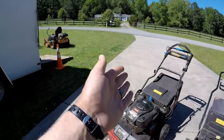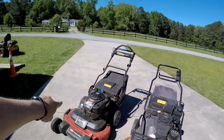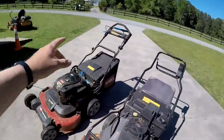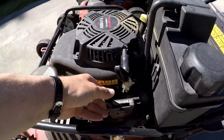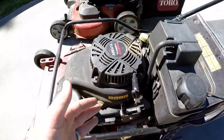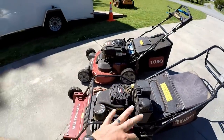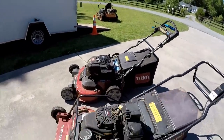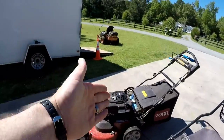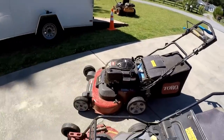This residential one is way more user friendly and lighter. If I pull up to a nice manicured yard tomorrow with both on the trailer, I'm going to choose the residential every time. One big feature I really love on the residential that the commercial doesn't have is the variable throttle. In the winter when you're mulching leaves and it's really dusty, you can turn the throttle down a little bit and mulch at lower RPMs so you don't have as much dust. The commercial just runs at full throttle all the time.